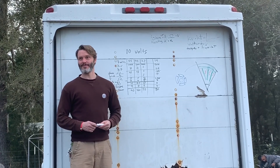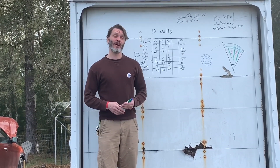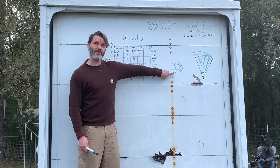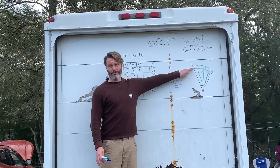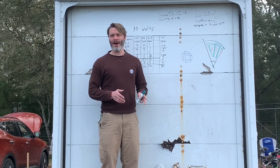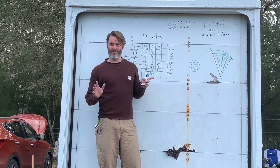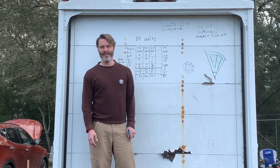On the topic of six-pole motors: when you go to a higher pole count you can get better torque density, but if you're not taking advantage of the back iron space by adding more magnets or copper you're actually losing torque density and power density - mostly because of the rotor teeth losing space for magnets. All the six-poles on the market today did not cut their back iron by 50 percent compared to a four-pole, and they did not increase their rotor size. The golden zone for a two-pole motor is between a 12 and 14 millimeter rotor. The back iron on an average two-pole is five millimeters, so going to four-pole gives two and a half millimeters back iron, gaining five millimeters of internal space.